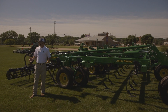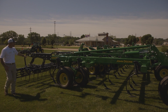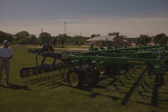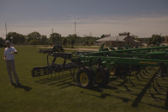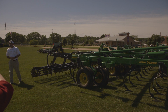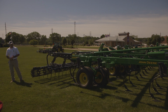A couple of more things, but it doesn't mean a whole lot if you can cover more acres faster. What you really got to do is be able to maintain the performance, the quality output, right? And that's what leads us back here to our rear attachments, our Pro-Finish leveling system. Our Pro-Finish leveling system allows our farmers to be able to go through and customize the field finish they want. You still got to maintain that smooth level surface on the top, to be able to have that consistent seed zone, so when you accurately place it, you're able to get that uniform germination, which ultimately is going to lead to increased yield opportunities. With it, we've got 6 different options here that can be customized for what customers need based upon their residue and their field conditions, soil types.